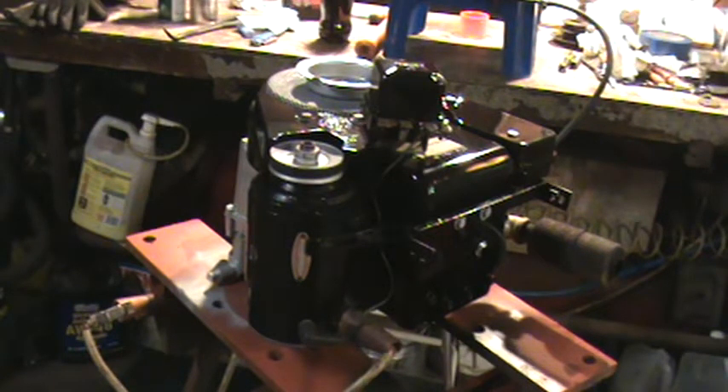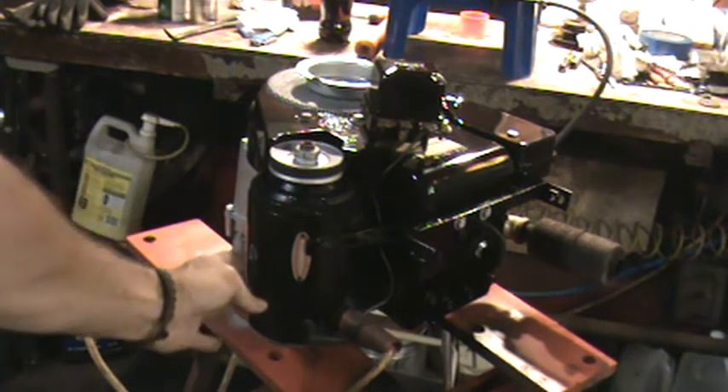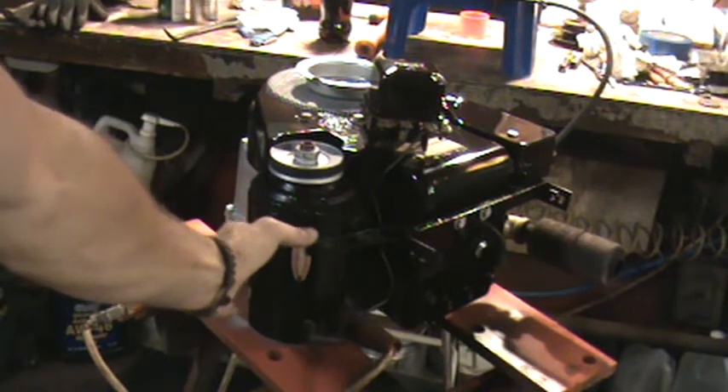The problem that I do have with it is that the starter generator either has a bushing that's worn out in the tail cap, or I've got some kind of piece of junk inside the starter generator housing that's causing the charging pole — which is on this side, what this screw is holding in — to rub up against the armature.